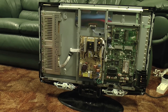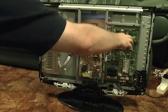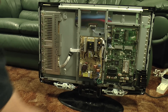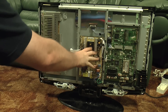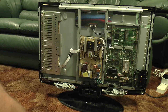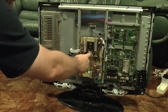Here's a view around the back. You can see there are several circuit boards in here — I've taken the covers off for clarity. We've got the main circuit board, a decoder board for a smart card, the main power supply board, and the inverter board. What we're interested in today is the power board. These capacitors can dry out and you'll get that sort of problem — stuck on standby — but the capacitors have been replaced on here and it made no difference.